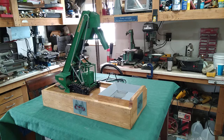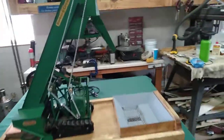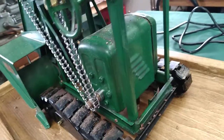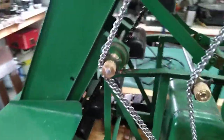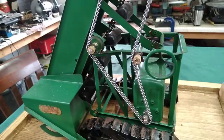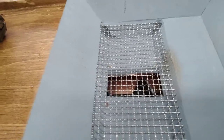We've got several modifications I've made to it. We have a new chain on it — it needed that. I put an 80 RPM 12 volt motor inside this fake engine housing. And we put roller ball bearings in these two idlers right there. I didn't do the top or the bottom because it's just too much work to cut all that apart — it's all sewn together. And we have an auger system in here. I'll turn it over here in a minute and show you underneath.